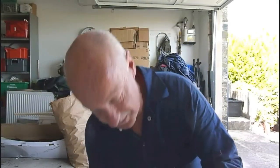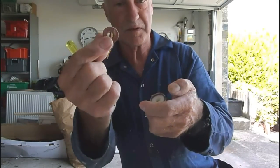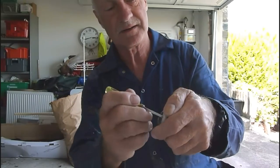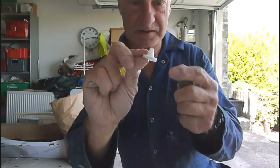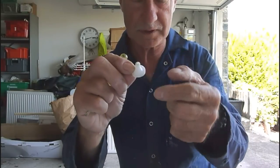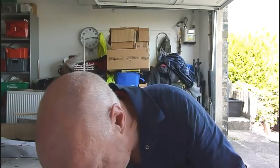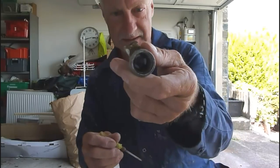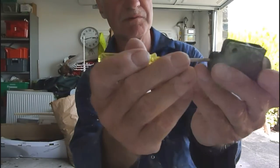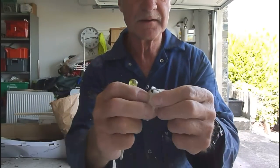I've put a little screwdriver in there and popped that washer off. This one won't replace in any event — if you can, you'll get it from a plumber's merchants. There's the seat, and it's probably best to replace it because it could have a cut across it, especially if you're in a hard water area. This is often what leaks, sometimes more than the washer, so that's something to bear in mind. Take that out and replace it. You can see the seat is stuck in there, so push it out from the back and it'll fall out.